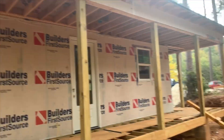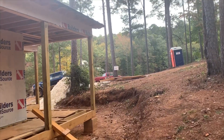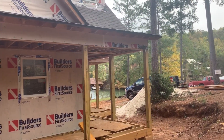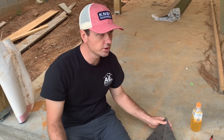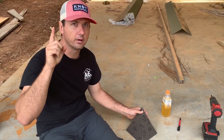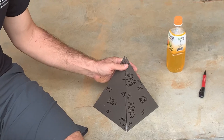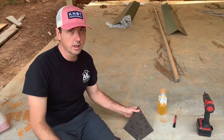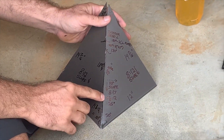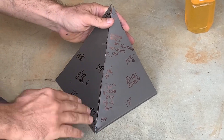The rest of this roof had three on 12 hips, so I overlooked specifying that some of the hip and ridge caps needed to be a different pitch. Now on site, we have an eight on 12 roof above us — that's 35 degrees — and the hips will be eight on 17, or five and eleven sixteenths on 12, which is 25 degrees.